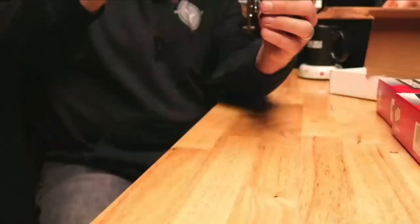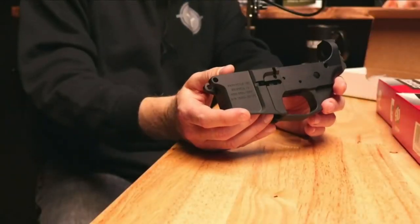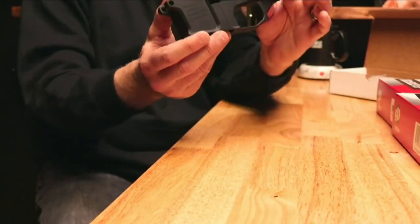This is an extremely well-made piece of gear — not a cheap knockoff AR-15 lower. This lower receiver is made from 7075 T6 aluminum and has a hard anodized finish. It's got an oversized trigger guard, so you don't need to put your standard AR trigger guard on that. This is a machined piece of aluminum.